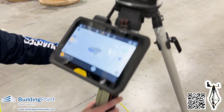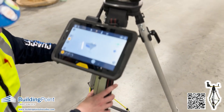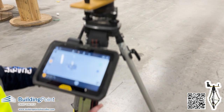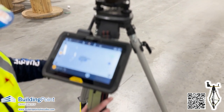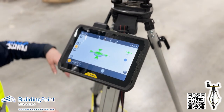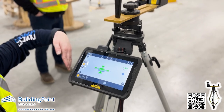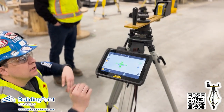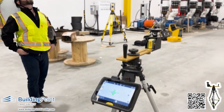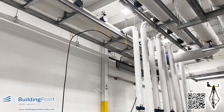You can fine-tune it by moving left and right — it tells you how to do it. As I'm moving it, it gives me the accuracy of the prism itself. This tells you how to move from the prism: straight back, left or right, or going straight towards it. Then it shoots the point out and you can actually see it hits where that rod is supposed to hit up on that beam.